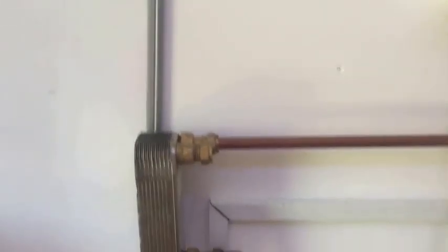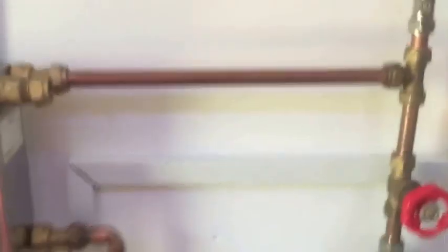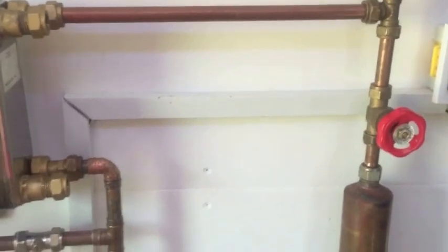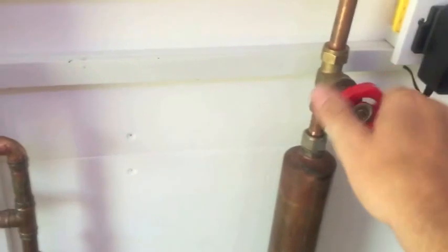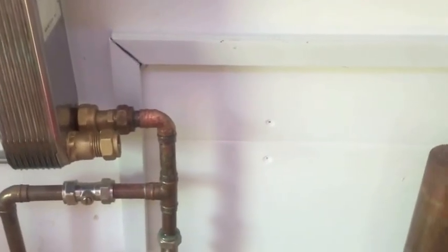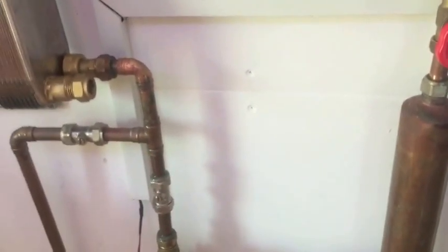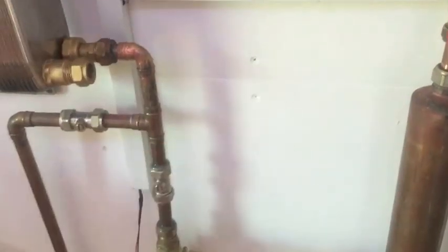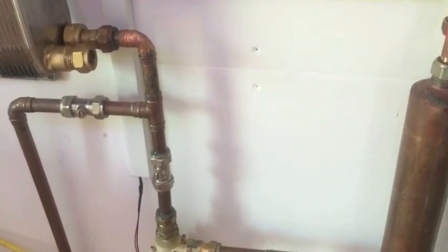It's not pretty - I might have to shorten that tube. But then again, it's a nice angle so the air will go 'bop' like that. I'll put this in as well just so I can control the flow - I want to actually control the actual flow of the thing. I've got that ball valve there but I don't think that'd be very accurate. So this way I could just slow it down. It's 3kW - I don't think it should be a problem, but if it's not heating fast enough then obviously you won't get the heat into the water. But I think I've got about 2 litres in that system.